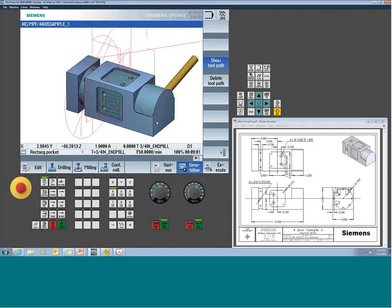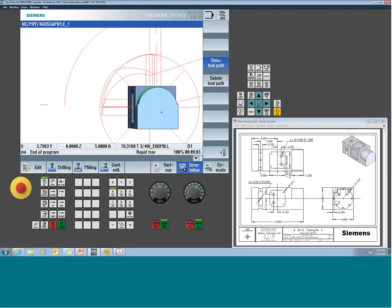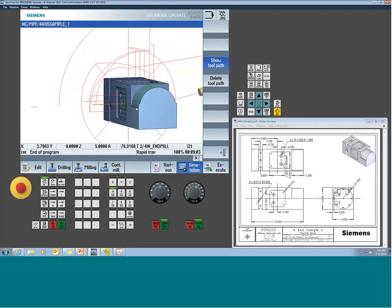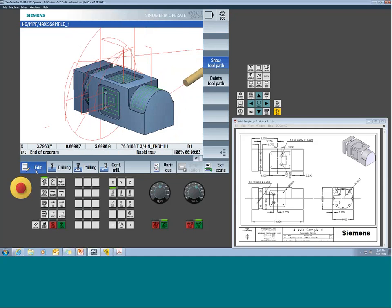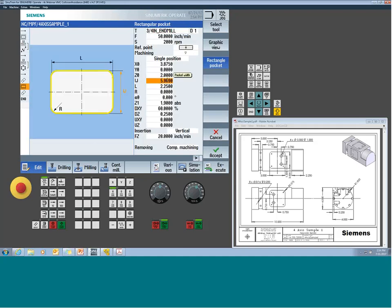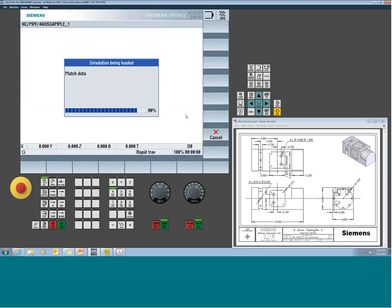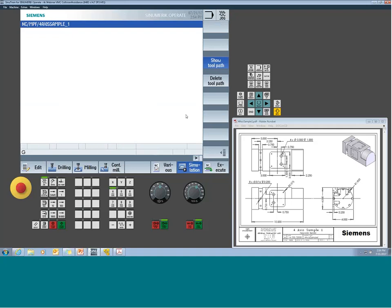All right, so now you see there was machining. So if I got the calculation wrong, that edge, of course we got a little radius in here, but this edge to the back edge would not be 180 degrees. So, as you start to maybe fool around with the cycle, that's the beauty of simulation, you can start to change this. Maybe I had thought it was 7 inches. So now when we simulate it, you're going to see it's just kind of wrapped further around the part.